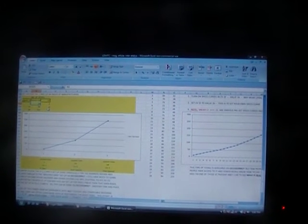Just say we didn't have a diesel as good as that and we wanted to, it doesn't roll at 1. Now there might be one turns up here one day and it's 7. It doesn't get going till 7. So what we'll have to do is increase the V start. So we might have to make that say 30. Right? Click, away she goes. Now I might have to move this up another 30 as well. So we'll make 90, 120.